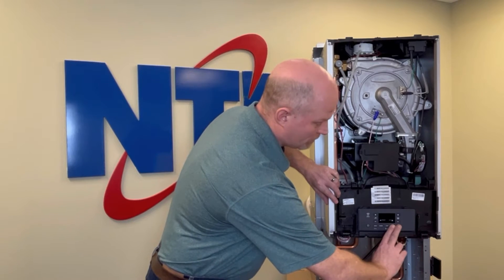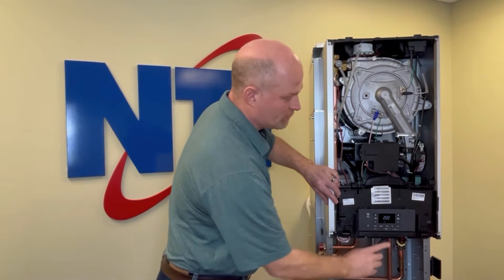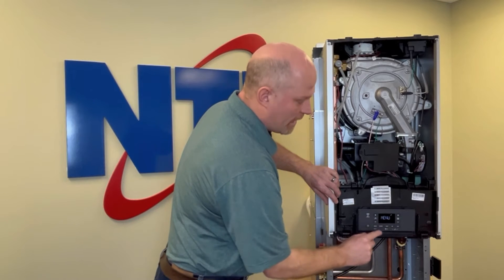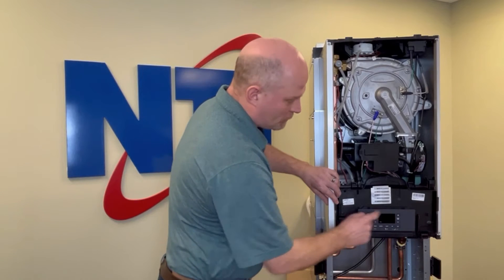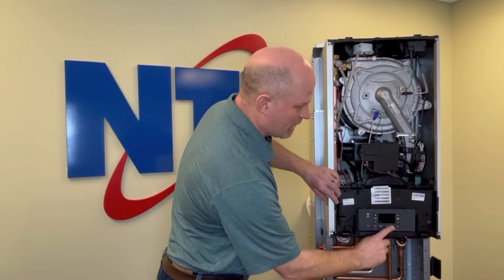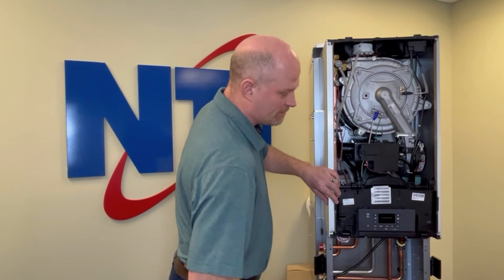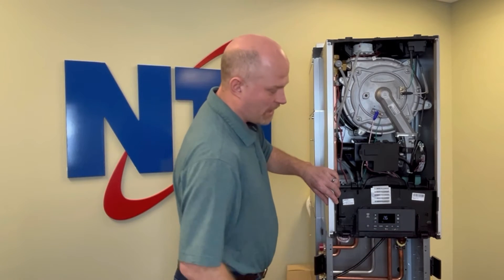To get into manual operation mode, press and hold OK and Escape. After five seconds, 222 shows up on the screen. Enter the code by hitting the plus button until you see 234 and pressing OK. Now you should be on the menu screen — hit OK and you should get a flashing zero. If you get three dashed lines, just wait a moment longer; the control is thinking. Go up to menu 2, press OK, up to number 6, hit OK again, and you're on 2-6-0. This is manual operation mode — set that equal to 1 and hit OK to save it.